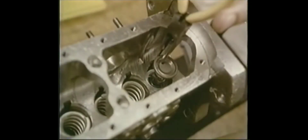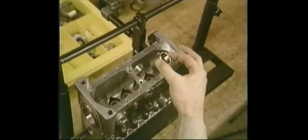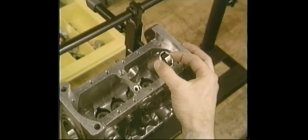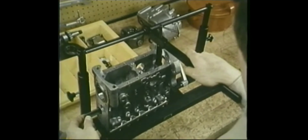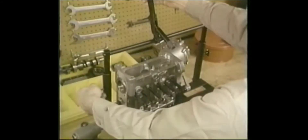Use care and test oil when you reinsert the tip of each plunger into its barrel. Fit the tool for compressing the plunger spring and install your roller tappet assemblies. Now you have an alignment job: the tangs of each plunger must line up with the control sleeve. Nudge the tappet with this tool as you move the rack bit by bit until you feel the plunger tangs enter the sleeve. Once that happens, push the tappet all the way down and insert the holder tool.